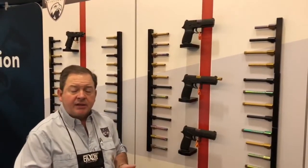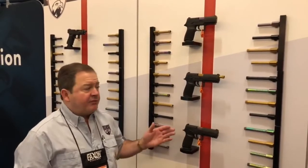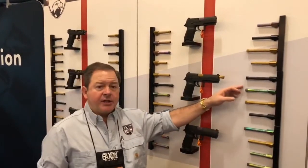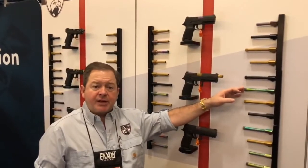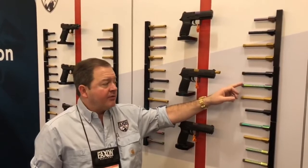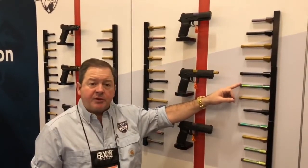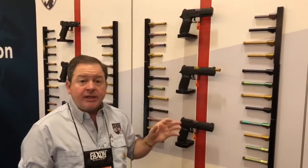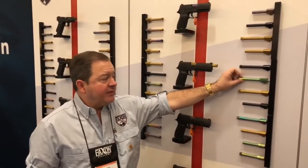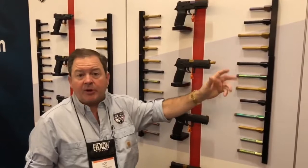We have SIG, Glock, and Smith, 45 different SKUs, threaded, non-threaded, stainless steel barrels that are heat treated, QPQ nitride coated to give the hardness and the protection inside the bore and chamber. Then we have a preparation on the outside if we put the PVD coating on. So we have multi-colors for the three different platforms, and also the flame flute on the outside for appearance. So we have all three platforms for the pistol barrels to announce at SHOT Show this year.